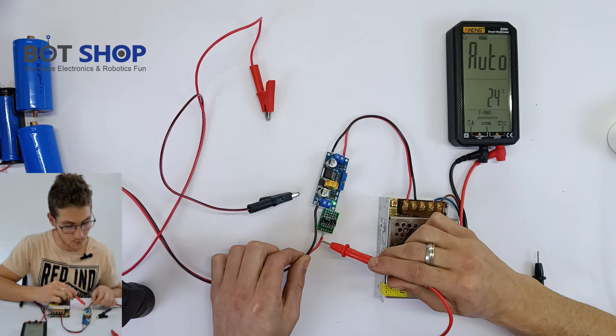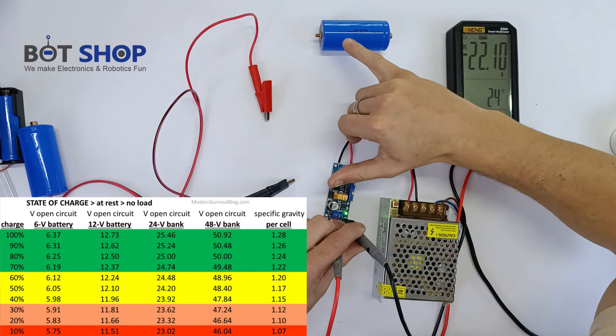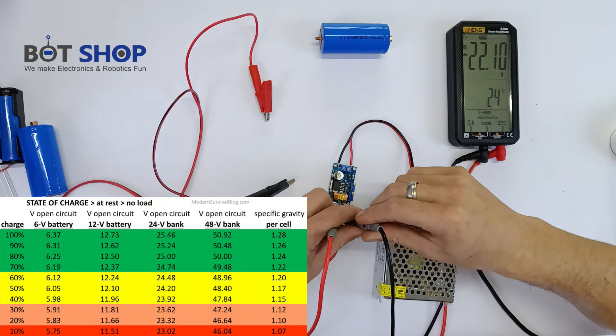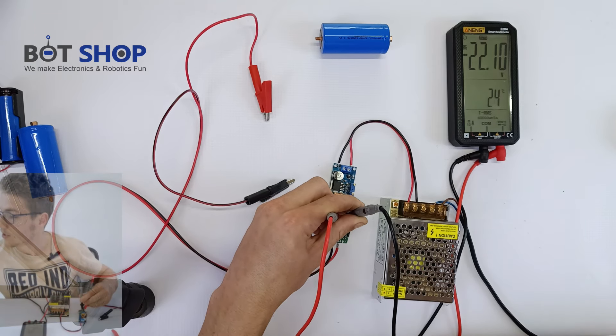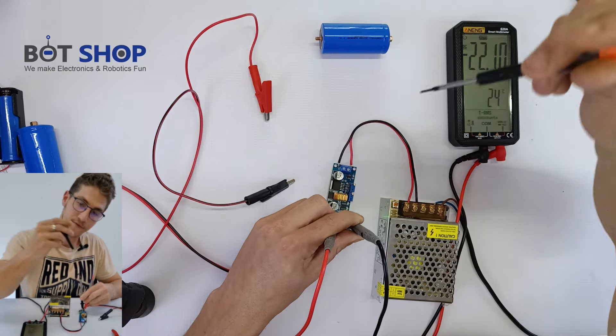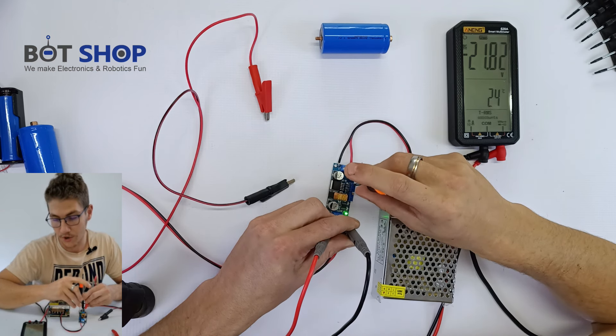On the output side there's 'out minus' and 'out plus'. On the 'out plus' I've added a feedback protection diode board. I didn't have any 10-amp diodes, so I used a lot of 1-amp diodes all connected in parallel. Make sure the white line on the diodes — on one side there's no line, on the other side there's a white circle — make sure that white circle is pointing towards your red wire. This is going to provide a voltage drop so that the battery's voltage and the buck module's voltage are not chasing each other. If you don't add these protection diodes, you run the risk of overcharging your battery pack.